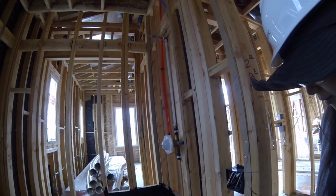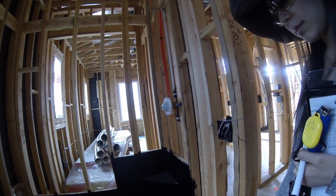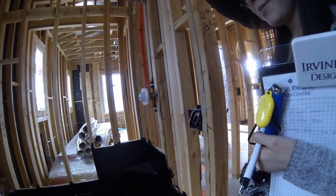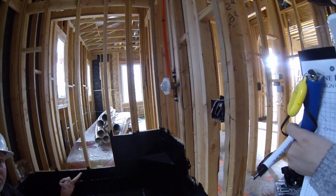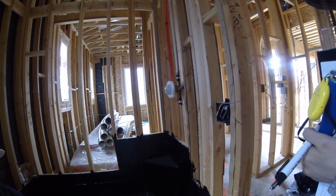Now, by the time you guys get to the house, you're going to have tile in here. Just remember, tile doesn't waterproof anything. Tile's just decorative. There's nothing waterproof about it at all. It's everything underneath that. And that holds true for the exterior of the house. Stucco and all that doesn't waterproof anything. Stucco's nothing but a big sponge.